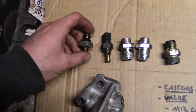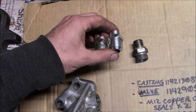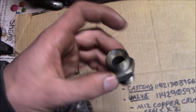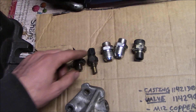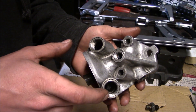Those correspond with the pressure switch and temp sender, which I'm using on my car. If you're doing this to an E30 M3, you won't see these. This is an example of what the E30 M3 fittings look like — these need the bigger crush seals and these take the smaller ones. If you decide to replace these two, here are the part numbers for those.